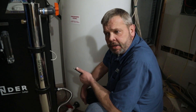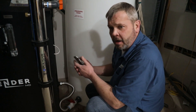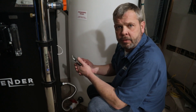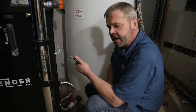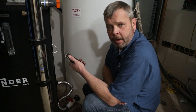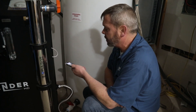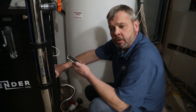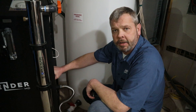In cold water applications, you may have to run at 150 PSI and still not meet your design flow rate — that's the nature of RO as well as cold water. When we have cold water, for every degree below 77°F, we lose about 2% of the output. So it's crucial that you keep that in mind when you're sizing a system. Typically, somebody in the north that would call me and say they need 2,000 gallons per day — I'm probably going to recommend a 4,000 gallon per day system, maybe even larger depending on water quality conditions. The pressure is crucial to the system's running success, and it's also relative to the temperature and ambient surroundings where you put the system.